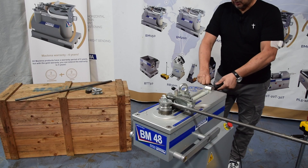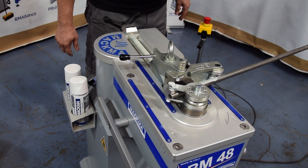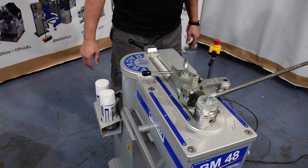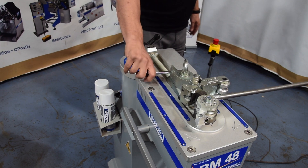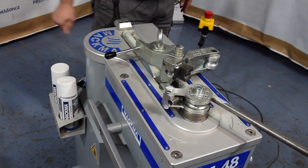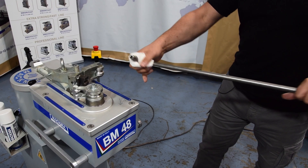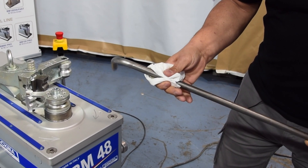Go to clamp the pipe. I want to bend a 90-degree bend, so let's bend. Here we are bending two times OD as well — diameter 16 with a radius 32. That's a really nice bend. Perfect.